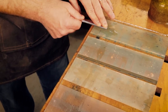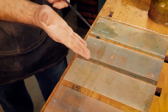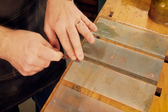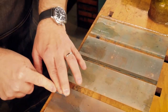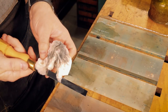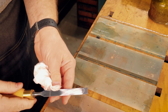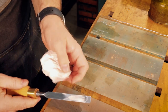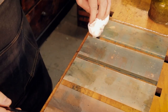In order to get a properly sharp tool, both faces have to meet at a properly polished surface — and actually getting that surface, that is the issue. So there we go: within a minute and three quarters, including talking time, I've got the back of that chisel to perfection.